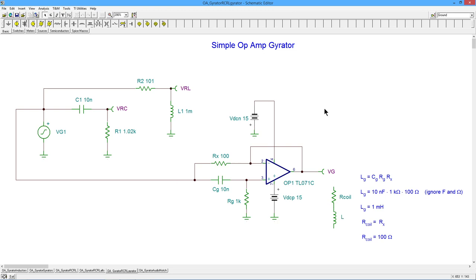Okay, so if this whole thing is basically an R coil and an L, how do I make a useful circuit out of this? I mean, this by itself just shows you it's possible to make a lead network, but you can do a lot more with it, right? Anytime you would use an RLC network, series or parallel, as long as you can configure it so that the inductor is tied to ground, because this thing has to be tied to ground the way it's drawn out, you can use this to replace the inductor.